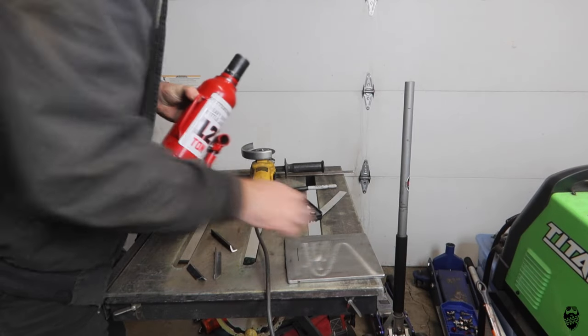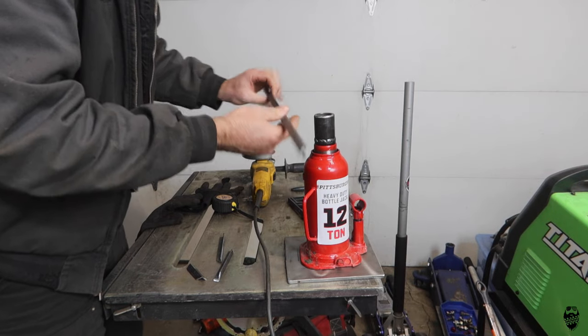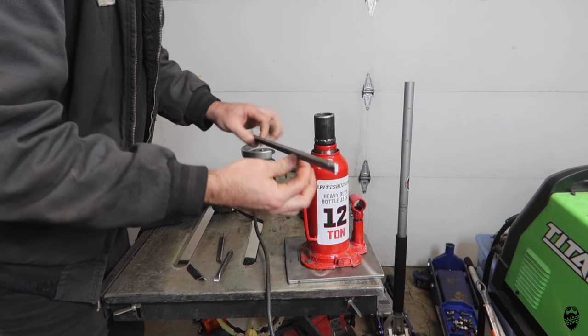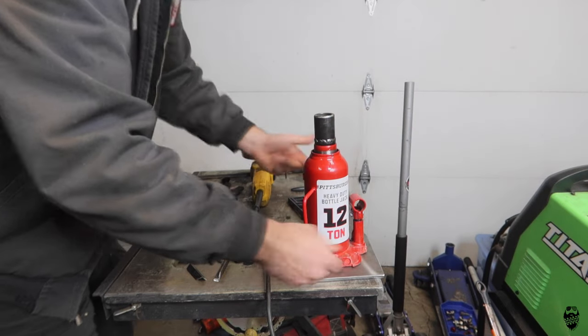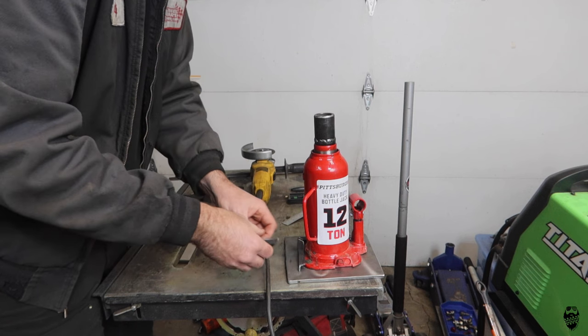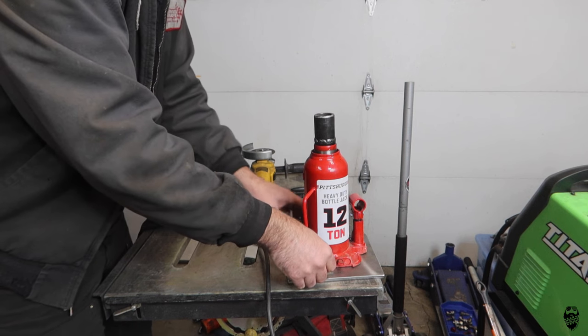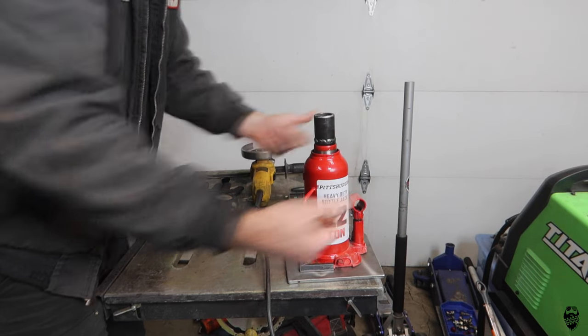I have this 7x7 plate that I have cut out and cleaned up. And then with this 1/4 inch little baby piece of angle iron I had laying around, I made the sides it's gonna slide into. These are gonna go kind of like this. Boom, boom, boom. Just like that. And this can slide in and out of here.